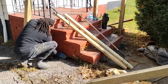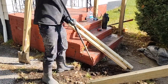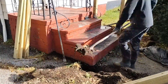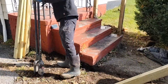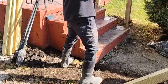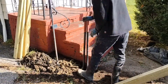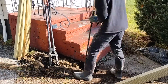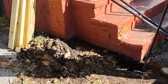After playing with the different options on this side, I decided to clean out the vegetation that was right here and realized that the asphalt was pretty weak. So I just took my breaker bar and broke down that whole side right there and was able to get to dirt - so it wasn't actually concrete underneath that asphalt, which was really good. I was able to dig that hole down and put the post in the original way. Before, I was going to try to attach the 4x4 to the brick steps, but as you can see there's plenty of cracks in it and it wasn't that sturdy. This option was way better and the asphalt broke up pretty good.